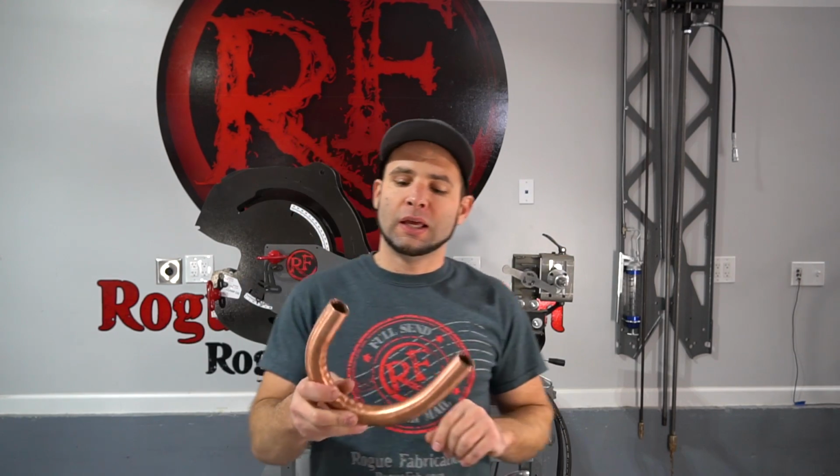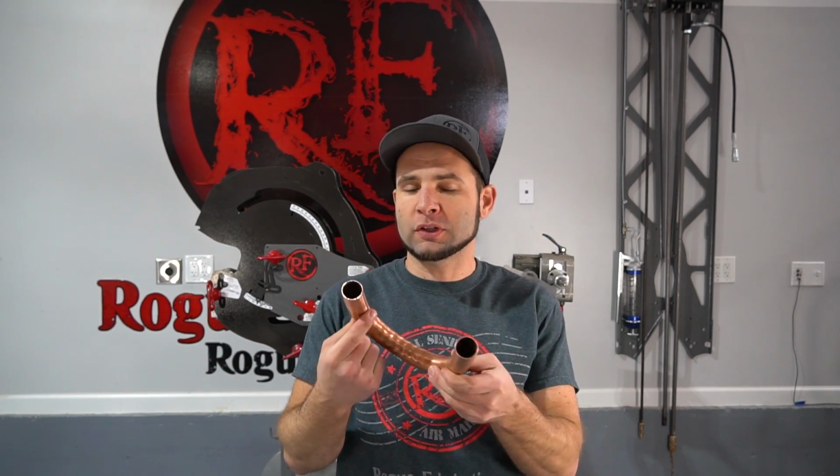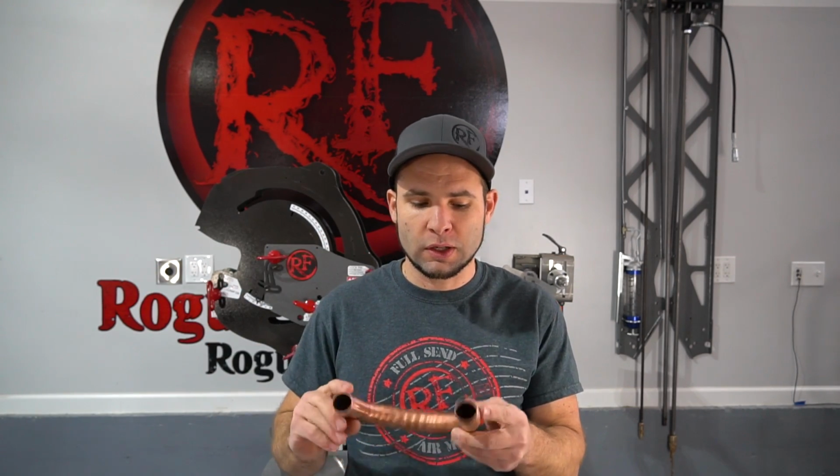We've also bent with our real mandrel, that guy back there, a 3-inch radius, same material, from the same exact stick even. And we were able to tune these wrinkles out. It was for a customer, so we sent a successful piece to that customer. But copper's pretty difficult to bend. It's super soft and loves to wrinkle.